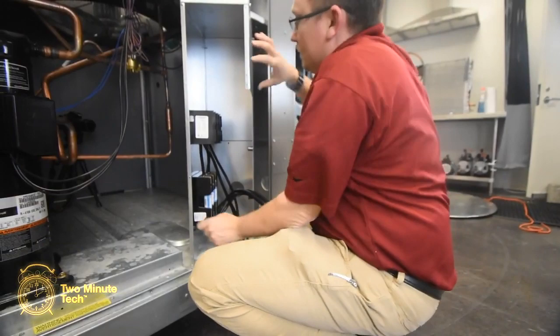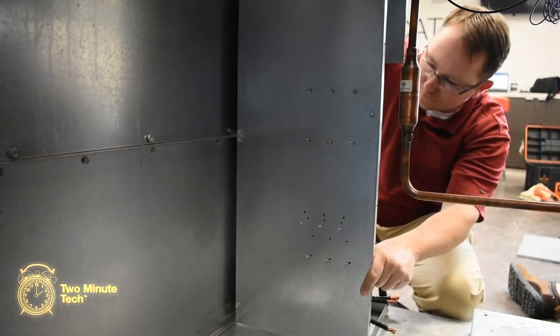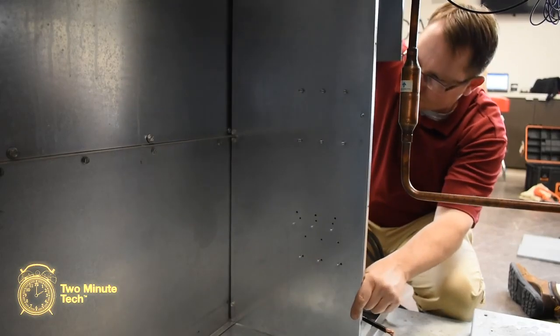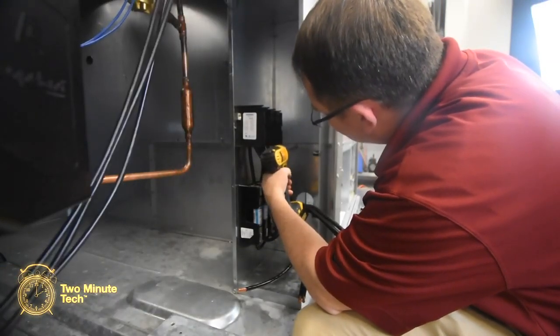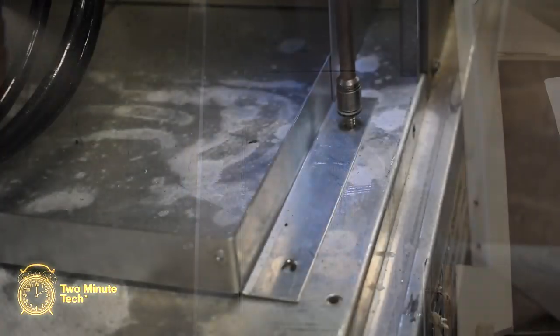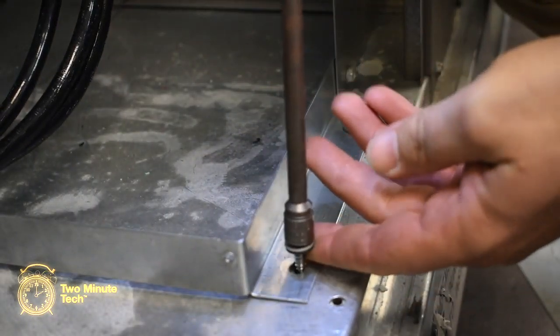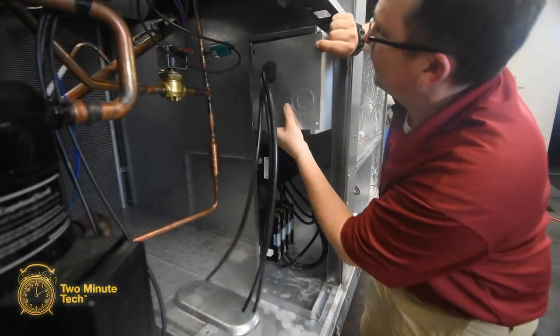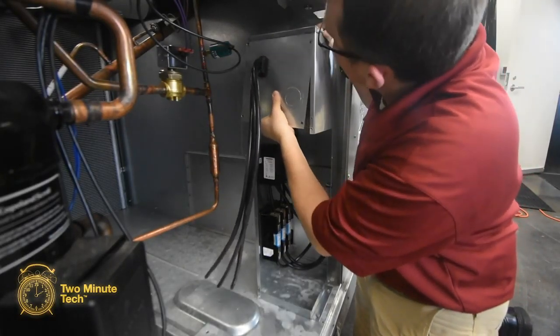Set the single point wiring kit into the cabinet and ensure the horizontal slot on the right side of the kit housing aligns with the flange on the bulkhead wall. Secure the kit housing to the bulkhead using the 3 screws previously removed at the bottom and upper side of the housing. Install 2 screws into the base at the front edge of the housing. Reattach the upper left panel to the left side of the housing assembly. This is the one with the compressor control wires.